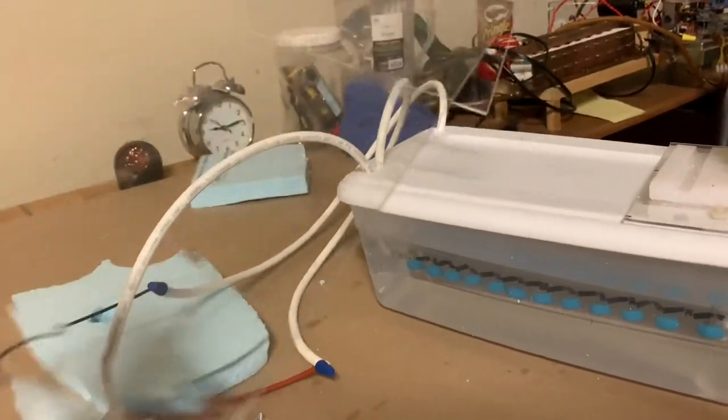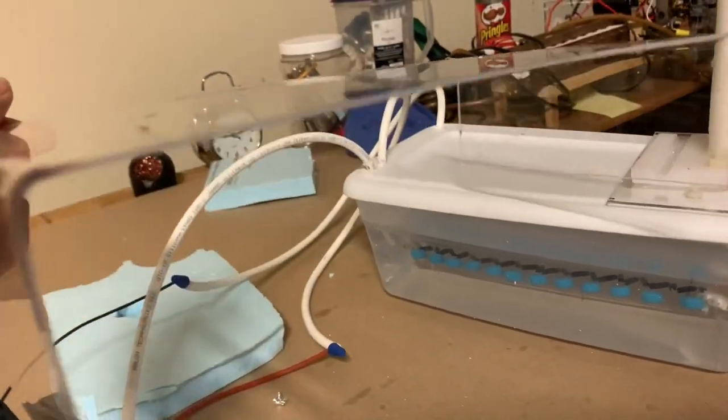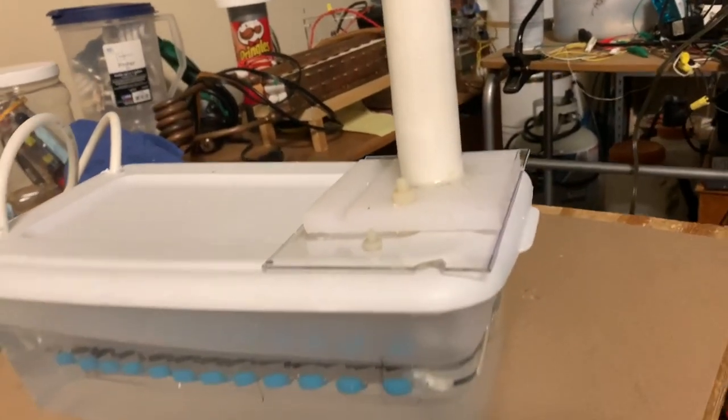You'll notice that in this container the multiplier is not sitting on the floor — it's sitting in the middle of the container, because the high voltage could jump outside through the air. I have it sitting in the middle of the oil, and I did that by using a standoff — you can use Lexan and bend it by heating it up to get this kind of shape. That's the basic circuit, resistor column, and now for testing on our first human subject.